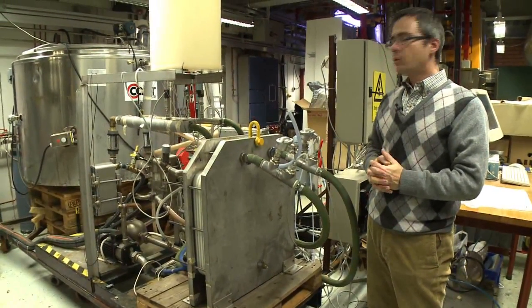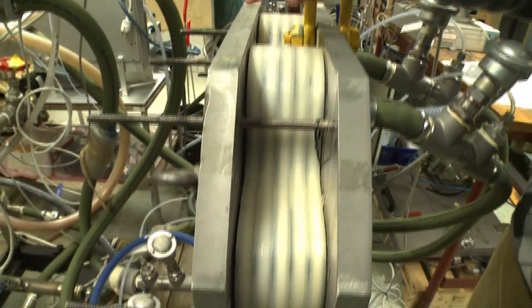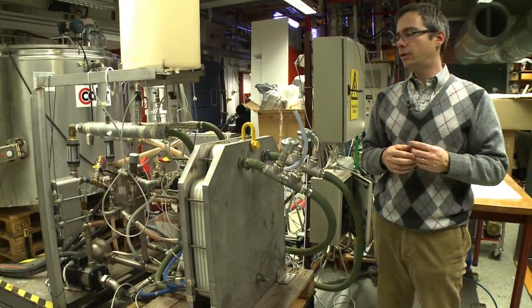The MD module is comprised of a number of cassettes stacked one upon the other, forming different flow channels, allowing the hot feedstock to come through, water to evaporate through the pores in the hydrophobic membrane, and to condense on another surface.